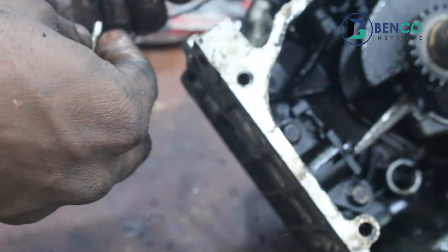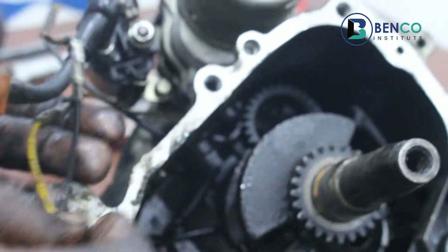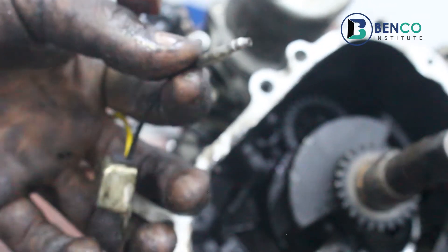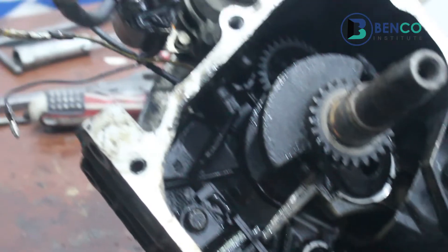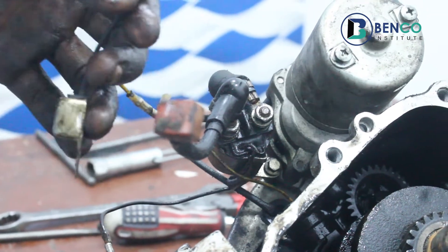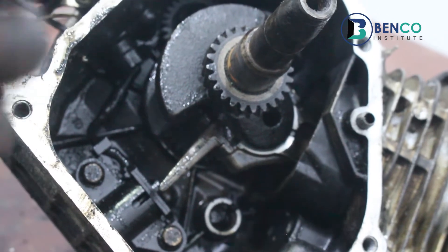It's connected to this — see the yellow fitting? This is connected to another part of the generator. We just want to explain how the oil switch works. It is somehow connected to the on/off switch such that when there is no oil, the oil switch activates the sensor, and the sensor sends a signal to the on/off switch of the generator that there is no oil, and the generator immediately shuts down.